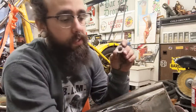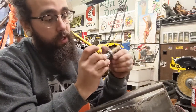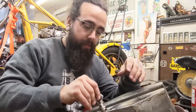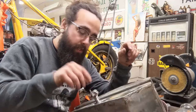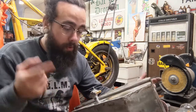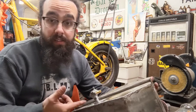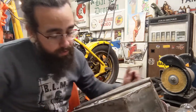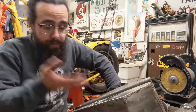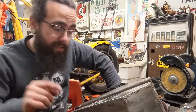All right, so when you're welding these in, because they're a taper, I never really know how to weld it in, if I should screw this on, mark where it starts to get tight, and then do it half a turn more, because you want it to sit like that. What I was thinking was getting it till it starts to get snug, putting it in, and then facing it backwards, because I'm going to tighten it a little bit more to weld it in. I don't know if that's the right way. Maybe someone else knows. You can leave a comment and let me know. Is there a right way to weld these things in? I suspect that because it's a taper, it doesn't really matter. You can put a little more Teflon tape on the outside or on the inside, and it'll work either way. So let's tack this, and then weld it all the way around, and then we can pressure test it. That's next.